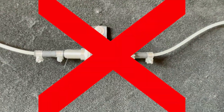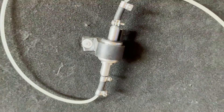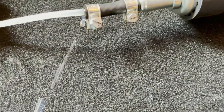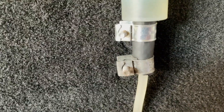Don't run these heaters as you drive — another name for them is parking heater, not driving heater. If your pump is at the wrong angle it can introduce bubbles into the line because of the way the piston works — make sure the heater side of your pump is at least a 45 degree angle upwards. You could also have a leak in your fuel line, so your fuel is not making it all the way to your heater. Make sure all your fuel line clips are tight and nothing is dripping out anywhere.